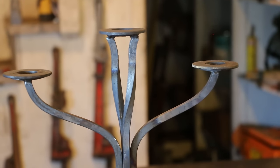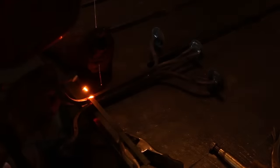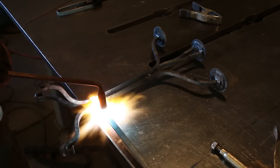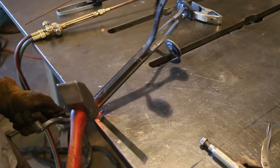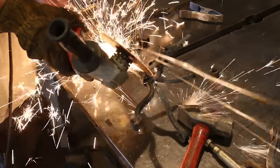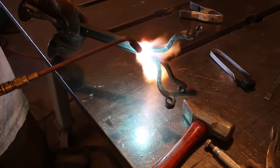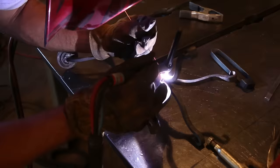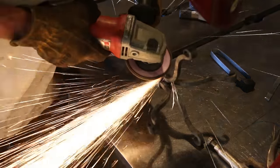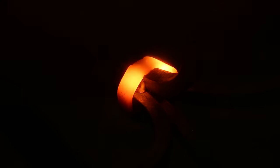The top one I had to just eyeball a little, but I think it still turned out all right. I was really glad I twisted the center two pieces — I think it flowed with the rest of it a little better. The last thing I wanted to do was wrap a couple of decorative bands around the top and bottom of the center shaft, hoping to hide my small welds and give the candlestick holder a more finished look. I tacked one side of the metal strip and then heated it up and hammered it around the shaft. Once I got it back around to the starting point, I cut it off with the angle grinder, heated it back up, and hammered it down into place. I then carefully welded both sides together. I've learned that if you're careful with your welds and try to keep them within the width of the strip, you can grind it smooth and heat it back up one last time and you can hardly even tell where the seam was.